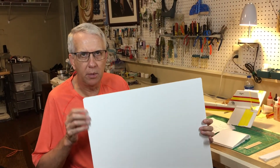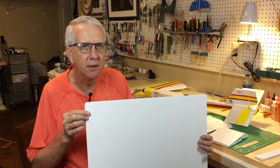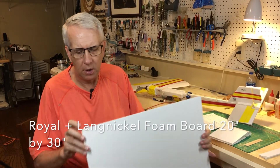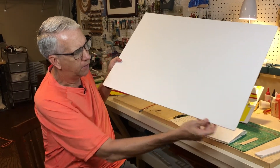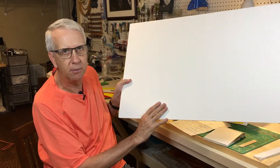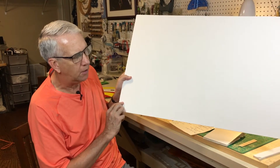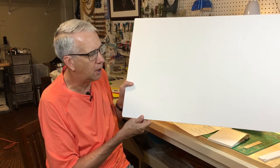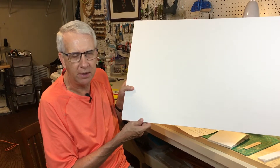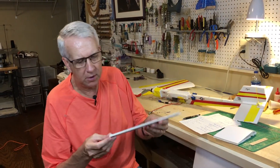The basic building material of the foam bug is display foam board. I got mine on Amazon — details of the exact product are in the YouTube video description. It's about 3/16ths of an inch thick and 30 inches long. A lot of people use this to build their foam RC airplanes; it's a good material to work with. Oftentimes you'll see a wingspan of 30 inches because that's the length of the foam. What I did is build two halves 20 inches long and connected them with a dihedral brace, which I'll show later.